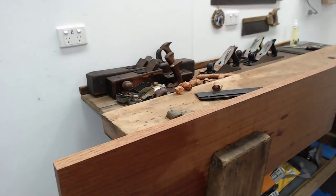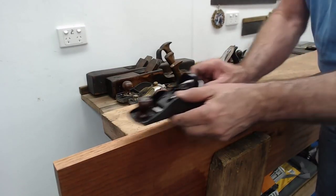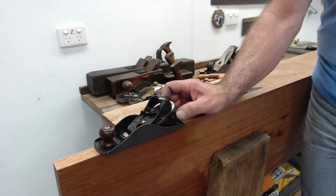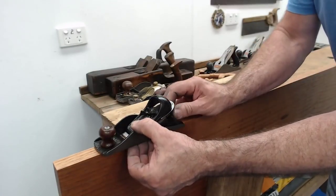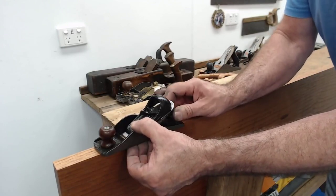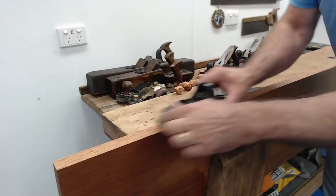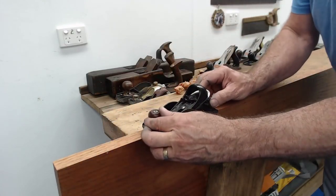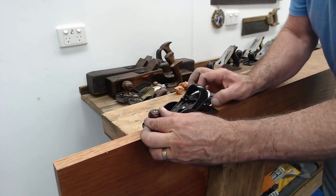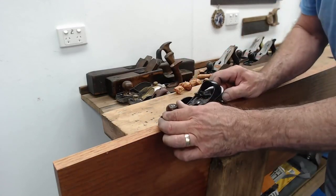All right, block plane on, and I'm going to turn this counterclockwise to pull the blade back out until I can't feel it offering any resistance. Okay, so that's moving easily now. Ooh, a little whisker came up. I'm going to turn it clockwise after it gets a grip. So you turn it until you feel the resistance, just a little bit.